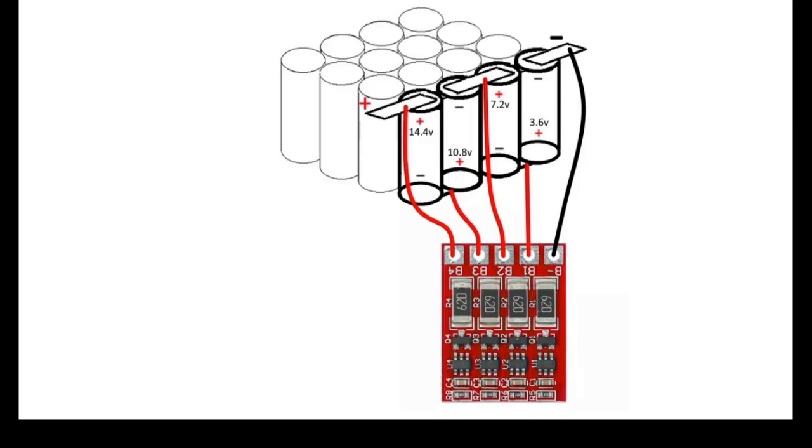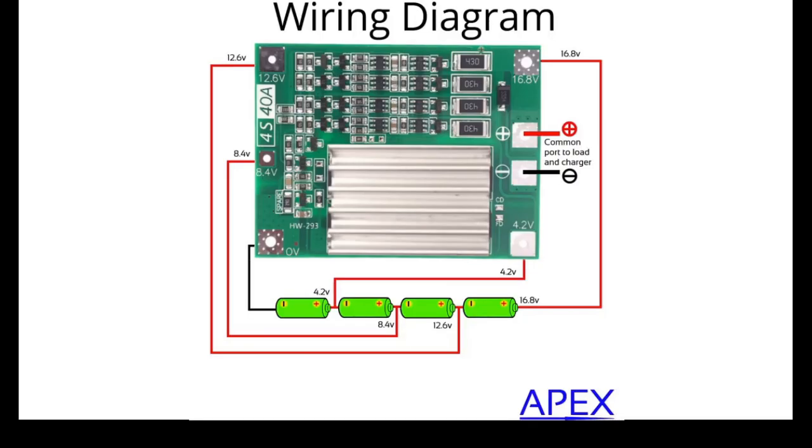In a lead acid battery you've got six cells side by side. If one cell is bad, it won't hold the charge and the battery won't charge to full capacity. With lithium, the computer sets the voltage for each bank and makes sure it's fully charged on its own. I use a solar cell — it has 18 volts without anything connected — and I connected it directly to the battery because the BMS is already inside the battery. Why would I put another BMS on the solar cell when there's already a BMS in the battery?